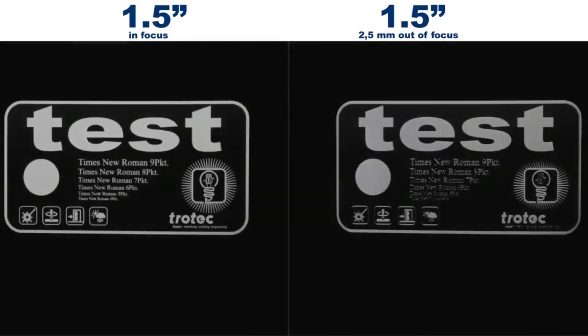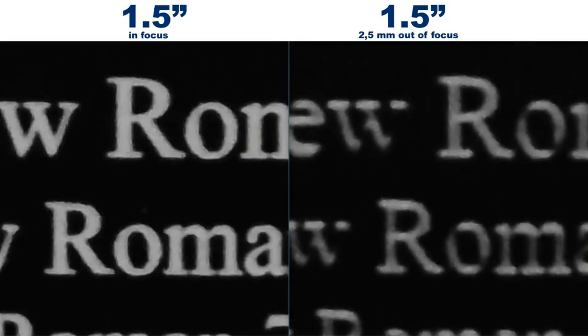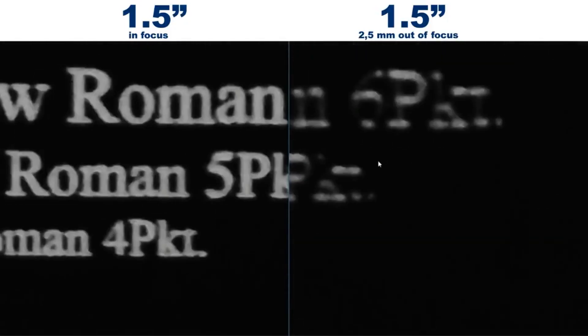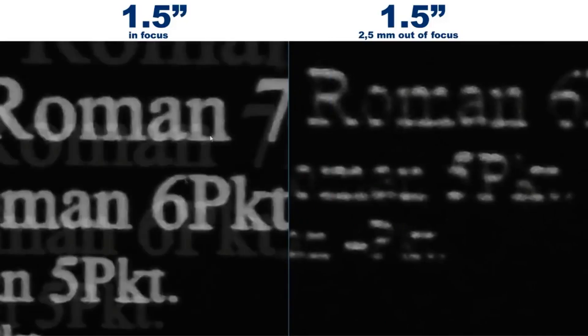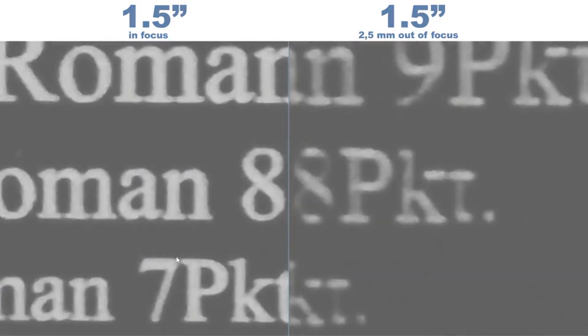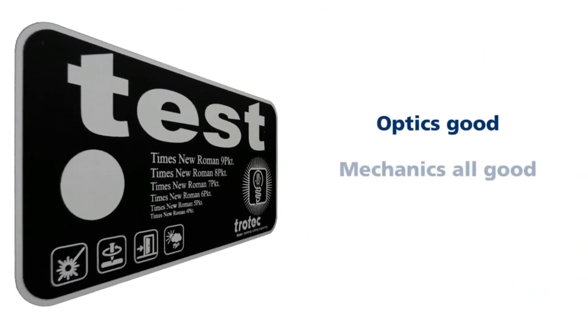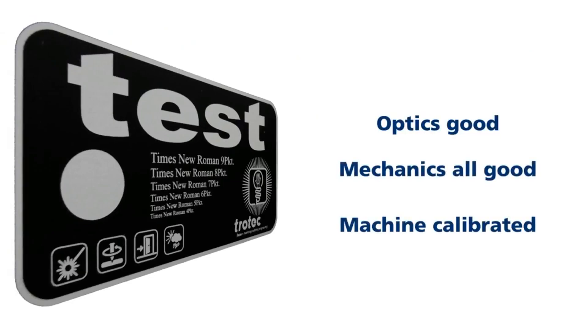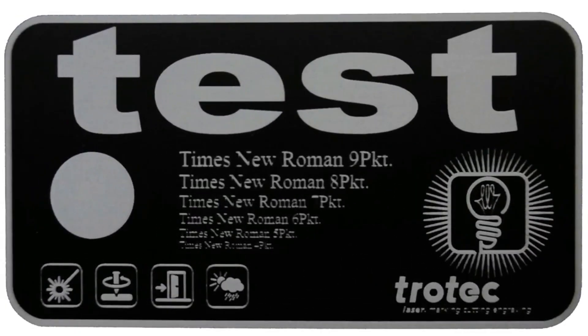If we bring up the sample that is 2.5 mm out of focus, meaning we are now outside the depth of focus, there is a clear distinction between the two. We can see that we have lost a lot of detail coming this far out of focus. Even if we move up to the number 8, we can see the details are vague when engraving outside the depth of focus. So the conclusion for the one and a half inch lens is that you should be able to engrave good quality four point text on anodized aluminum using the standard settings, assuming the optics and mechanics are all good and the machine is properly calibrated. If the material is outside the depth of focus, we can see a clear drop in quality with a loss of power or intensity and detail.